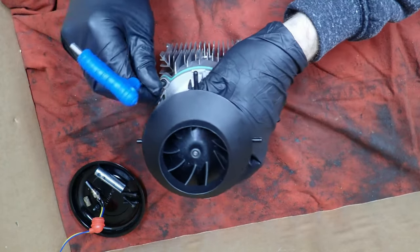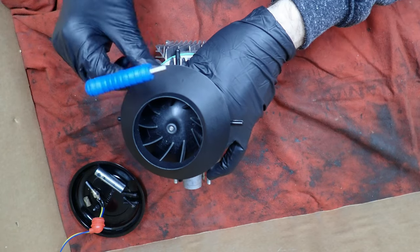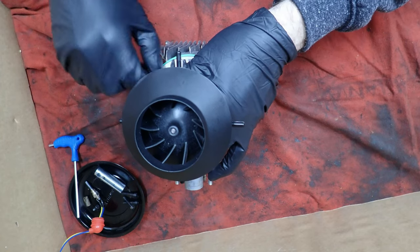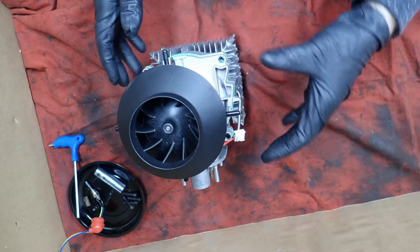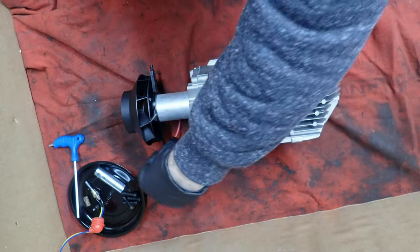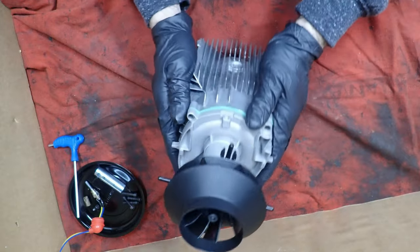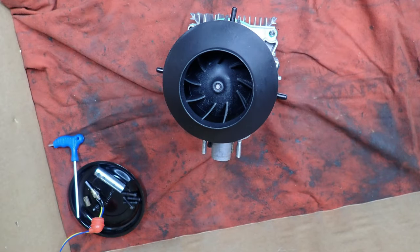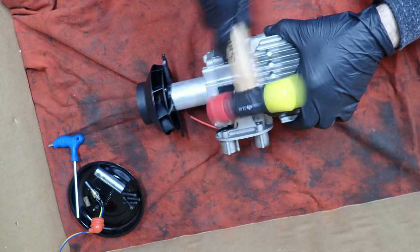And when we get to the gasket part, I'm going to go ahead and use a wire wheel, because I've got a bench grinder with a wire wheel. If you don't have a wire wheel, I would just go ahead and get a scuff pad, probably 80, 120, just to clean the surface when we put the gaskets back on. We'll get the surface clean enough. Boy, that puppy's stuck in there good. I think I had to use a rubber hammer last time. See if I've got a rubber hammer that's small enough for that. We don't want to be real violent with this, but we've got to break it.